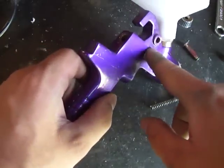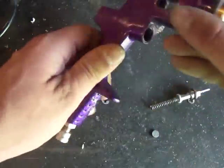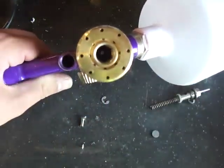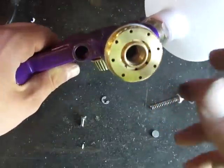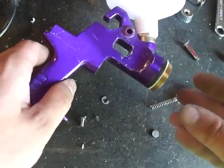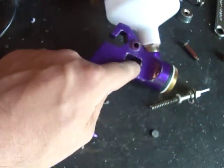First of all, it was leaking paint like a sieve out here. Now, there's a screw down in there that you stick a flathead screwdriver in, you turn it, it compresses the O-ring a little bit more, squishes it in so it grips the shaft a little tighter, and it stops leaking.